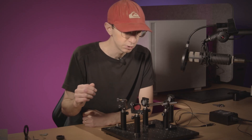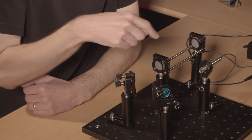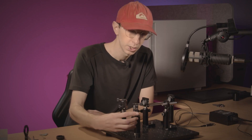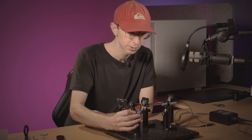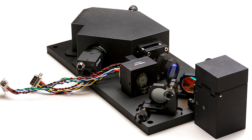It's also recommended not to send the beam up in space — that's for safety purposes to protect your eyes. You're basically left with two configurations: the U configuration, which is what I'm using here, and the zigzag configuration, where the laser is placed the other way around. For coarse alignment, if you are using a CNC-machined plate like I do for most of my projects, you will be really close to the final target and don't need much coarse adjustment. I really recommend having some kind of CNC facility at your lab to pre-machine the holes if you can afford it.